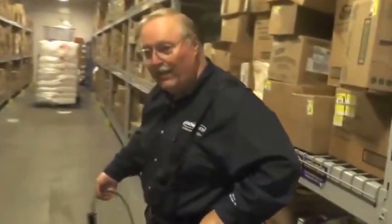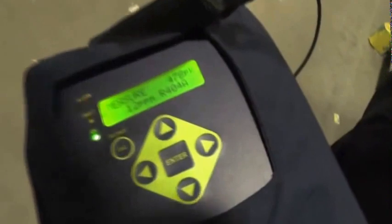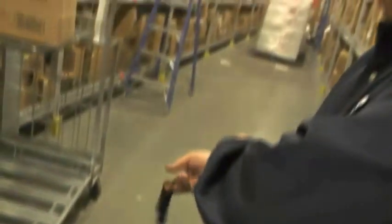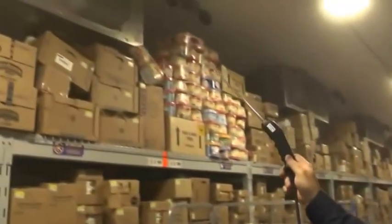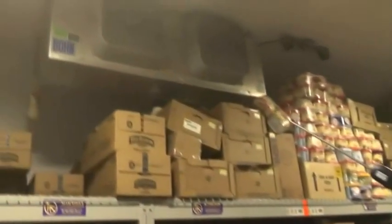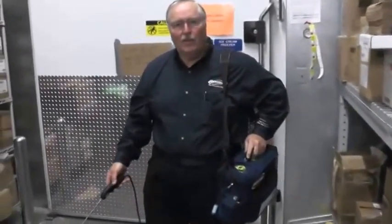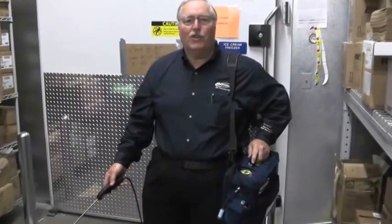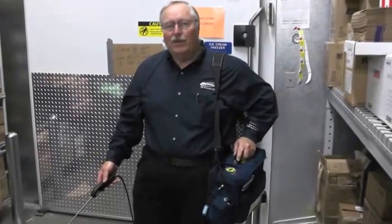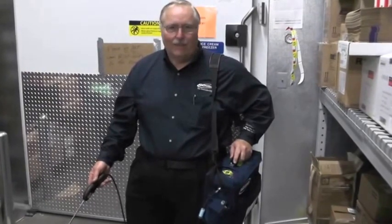The higher concentrations are going to be near the floor. As our beep increases, we have about 12 ppm background in here. We can also check the airflow from above, but to check this correctly you would need a ladder to probe around the cases, the expansion valve, entry tubing, and things like that. The detection level in the freezer was constant all the way up and down, which means it's just been in dispersion — those fans are stirring it up pretty good. So you really do have to shut the fans down and put it in defrost to pinpoint exactly where those leaks are.